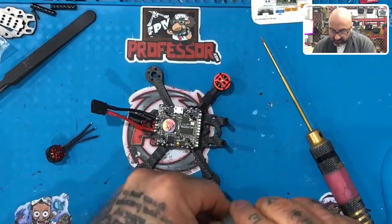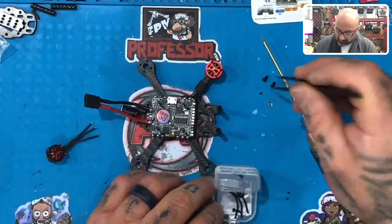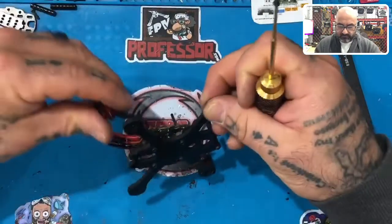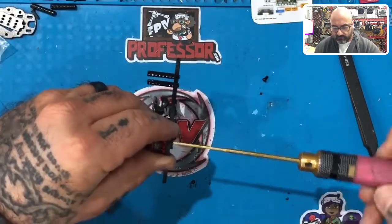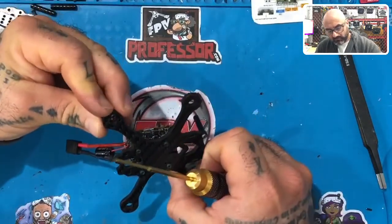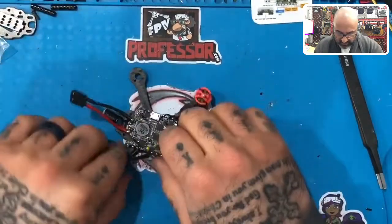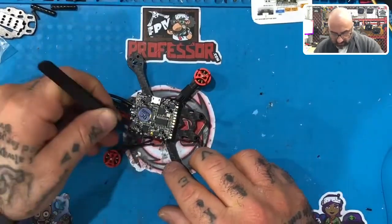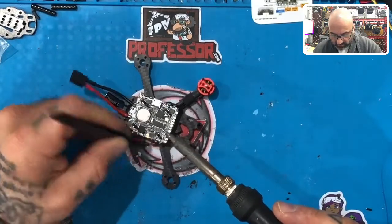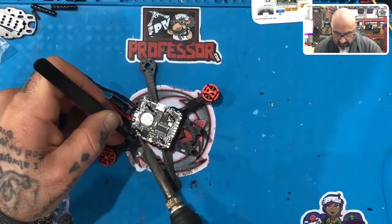And let's see, I had the other set of screws here, so you're gonna grab again, grab two screws, two of the small ones. Let's mount the motor real quickly. Excellent. Okay. Now, what we're going to do here is we're going to do the same thing we did on the other part. We're going to take the wire. We're going to solder it in this order, just like this. So let's go one, two, and three. Just like that.